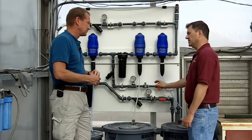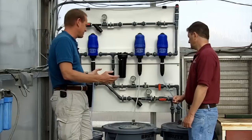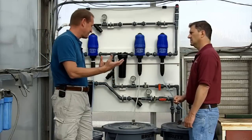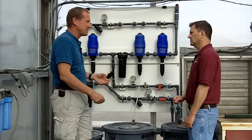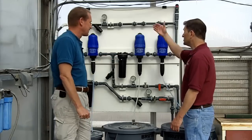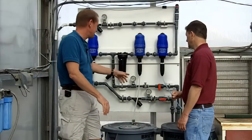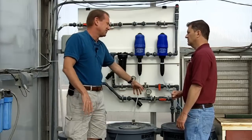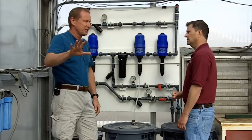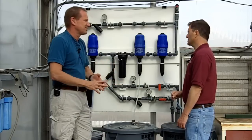You have to remember periodically to check those filters — that's important. You need to check them for particulates, and also you'll get stuff collecting from the fertilizer solution. Otherwise your pressure is just going to keep dropping and the system is going to stop working. We also have pressure gauges throughout the system to see how things are operating. You do get pressure drop across the injector — all that action going on will lower the pressure. We use pressure-compensated emitters, so if pressure falls below the PSI requirement it just won't work.